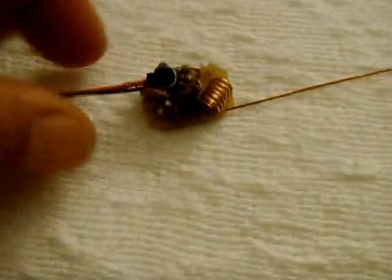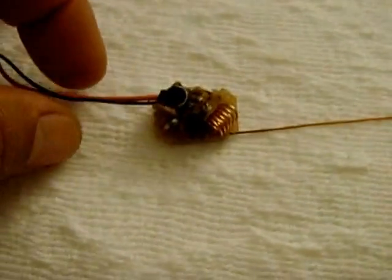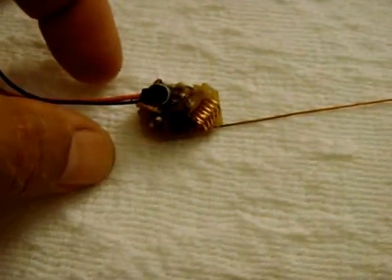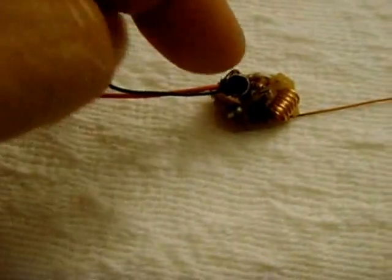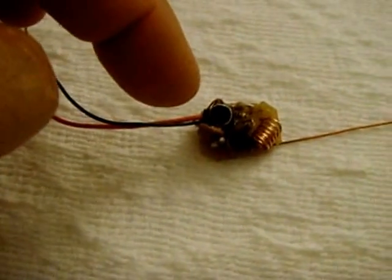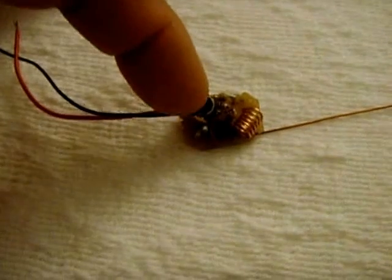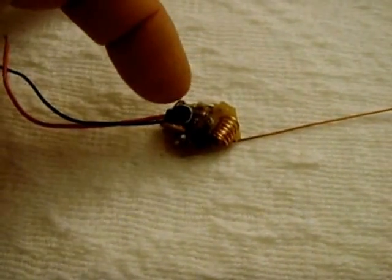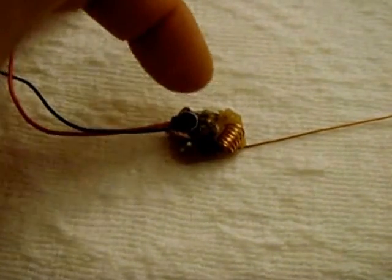I designed it — well, I made a few changes. I found some schematics online and a lot of them really weren't stable. I wanted stability and a lot of runtime, so what I did is I added a zener to this particular circuit. It runs on six volts and there's a 4.1 volt zener in here, so the voltage remains very steady.